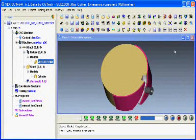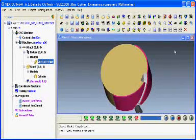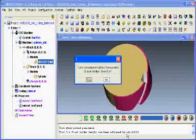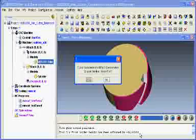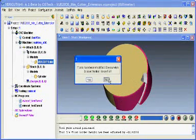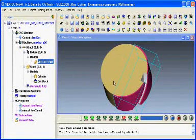Now, if you remember rightly, at the end of the last simulation we had a tool length calculation of 24.777. In this case it's now reduced by 16.942, i.e. it's had to increase the length of the tool by roughly 9mm. Again, I'm going to say no. That's how Vericut now works with not only if the tool is too short, but it will also work with a tool that's too long, and it checks against fixture components.